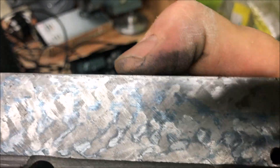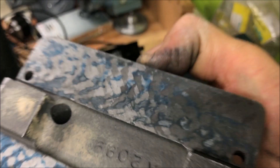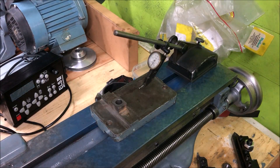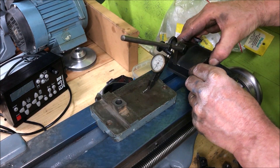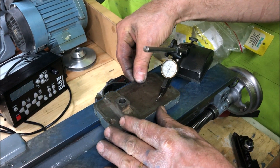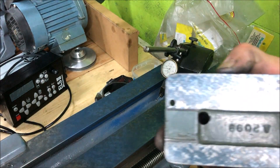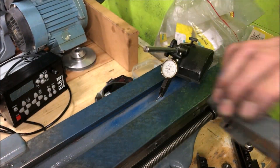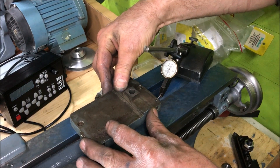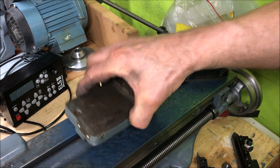So I'm still a little bit better there than here, but it's coming along good, I think. And as a test of the scraping, you have to test the flatness of the piece here, so I try to go all over. See if it's flat. This is already one other one that is scraped — this falls back to zero. So quite good, this one also.